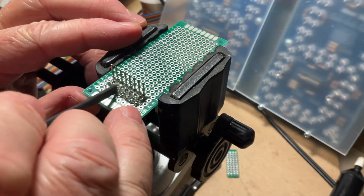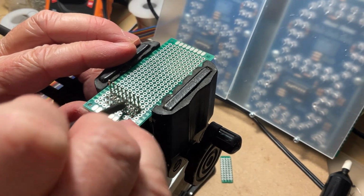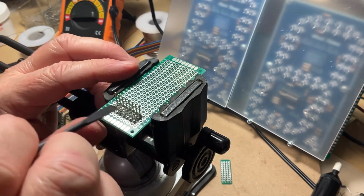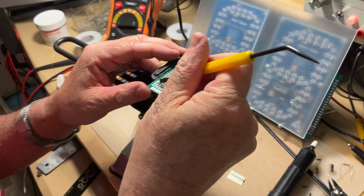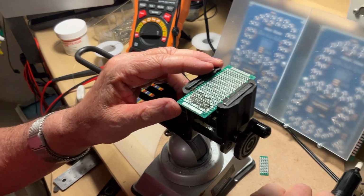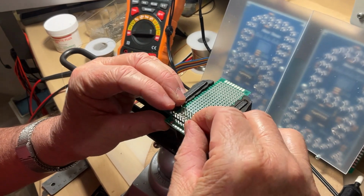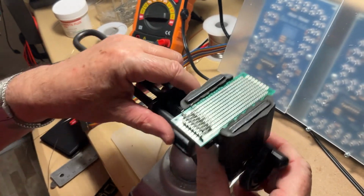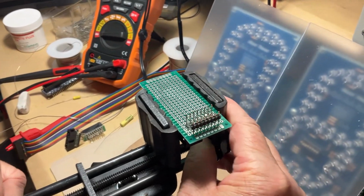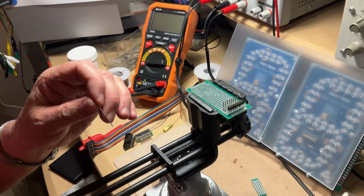You can always check with a scratcher like this to prevent unwanted little pieces of solder remaining. And now you should try to do the same thing over the other side, okay? So you put it in the same position. You try to keep it vertical way if possible, but because you can't make sure about that from the beginning, you only solder one pin like you did on the other side.